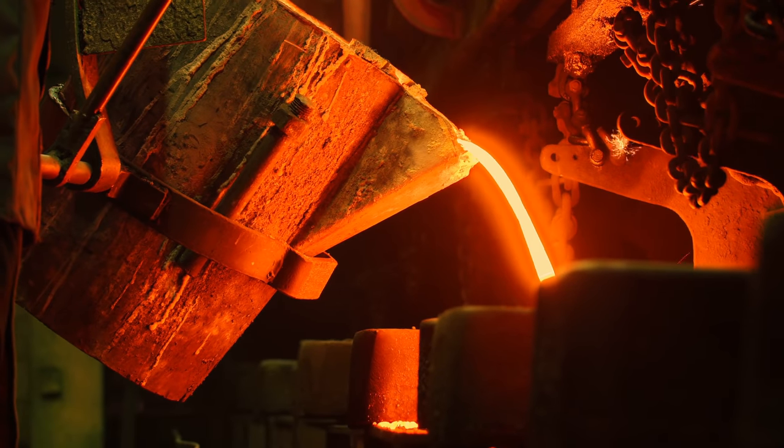The ones that are really better, a stage further up, are the powder metallurgy steels. Powder met steels are in a class of their own because of the way they make the steel. With other materials, you melt your steel in a big furnace, pour it into an ingot mold, and let it solidify - which can take hours. During that time you get what is called segregation: the steel starts to solidify at one temperature, and from when it starts to when it finishes can span up to 100 degrees centigrade. During that stage you've got a combination of solids and liquids, and the first bits that solidify have a different composition to the last. There's not much you can do to stop it.